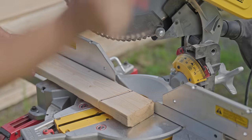That's why we're going with the 5/8 instead of the 7/16 OSB. The tongue and groove is a nice feature. It might give you a little more support, but the thickness of this is better than any roofing system out there. So it's worth spending the extra couple bucks. Now, as far as the gap across the top, we're not going to just rely on our shingle. I'm going to use a joist tape like we would use on building decks to get a waterproof seal. I do have a membrane to put on the roof so we can make sure that all the gaps and cracks are water repellent. And then of course, we're going to go with architectural shingle.